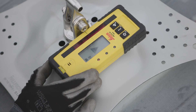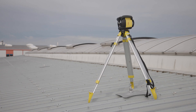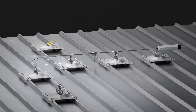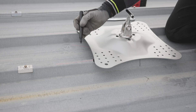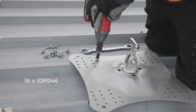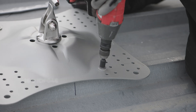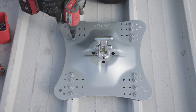Measurements can be made with sophisticated tools such as laser distance metres or levels for more accurate and professional installations. The minimum radius allowed for a curve is 400 millimetres (15.7 inches). Measure the distances accordingly and place the plates, first removing the paper protecting the sealant tape. To install the IDF-053 bracket, it is absolutely mandatory to use 16 IDF-046 self-drilling screws or rivets provided by FallProtect. The IDF-046 self-drilling screw has been designed according to FallProtect specifications.